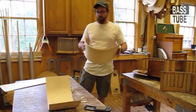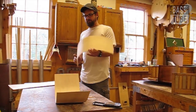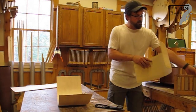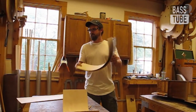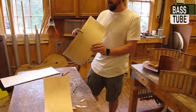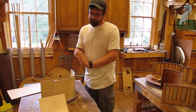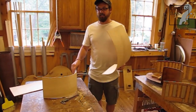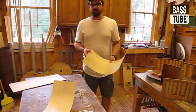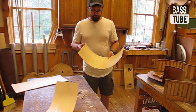Three pieces of plywood — it should be an odd number so that we have no tension built up in the wood, and so on and so forth. This piece of poplar that's pressed and glued and turned into a piece of plywood to make roughly the lower bout of a bass — it's about 2.6 millimeters thick. And we have the same here for this guy, 2.6 — this is like 2.68, 2.65. This one varies a little bit more than this guy. This piece of wood weighs 6.825 ounces.